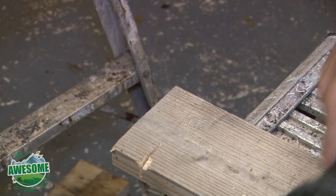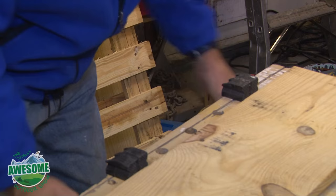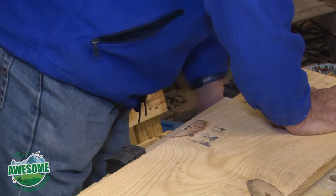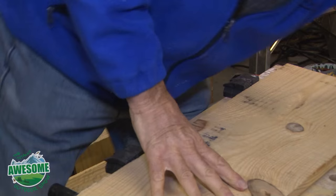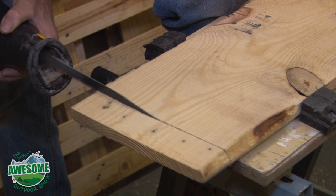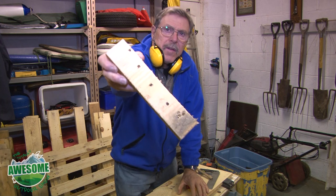It's a quick way of doing it - a little tip. I've laid my wood here and I'm just going to wind these clamps up tight so it pinches the wood between those black clamps. This one's an old one - no wonder the guy threw it away - but there's nothing wrong with it whatsoever. I'm going to start by making an initial cut drawing the blade back across here with a hand saw, then use a reciprocal saw to cut along there.